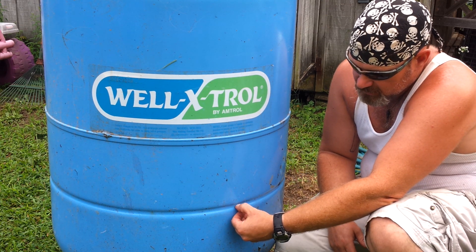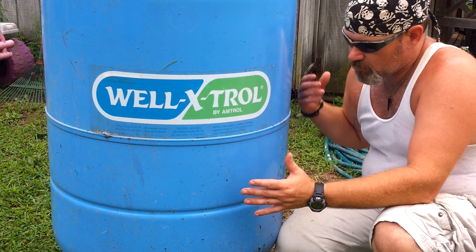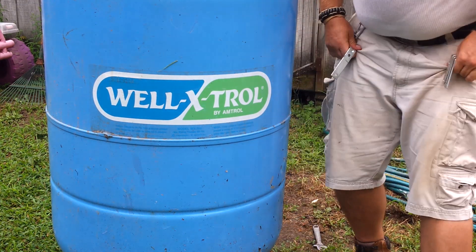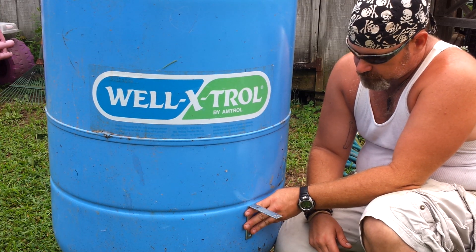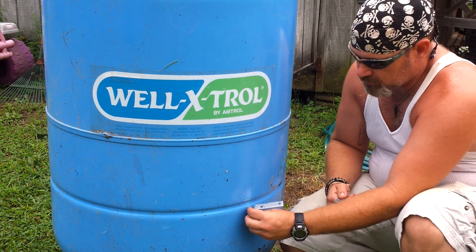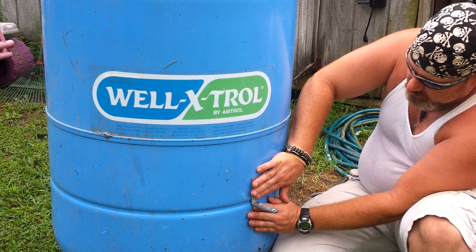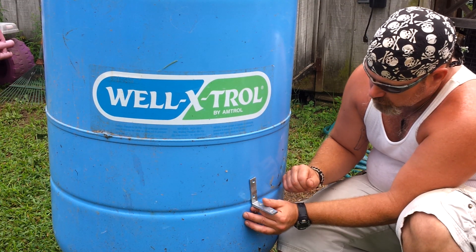I'm going to cut it along this line so that this indention here will slip inside the other section, and the top will be removed. I'll probably make these out of small pieces of one-inch angle iron, and what I'll have for spotters is a pin in the lower section and then one in the top section so that the indicators will line themselves up when I go to put it back together, and that'll help hold it sturdy as well.